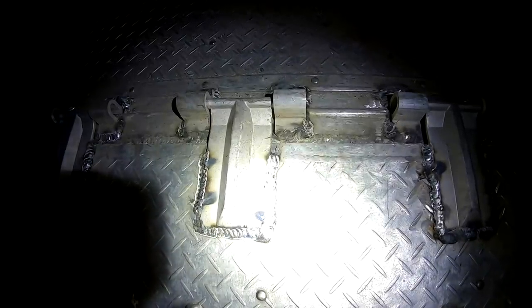And then this here, we completely redid all this, hinges, welded all that on there. That goes down like this. See the new hinges here? I'm trying to get my light to where... There we go, that's about right. I hold the new hinges on there. And then this was so thin, I was worried about making that weak. So I took a piece of strap and welded it on the back side of this gate, because it was riveted in, but I welded it on.